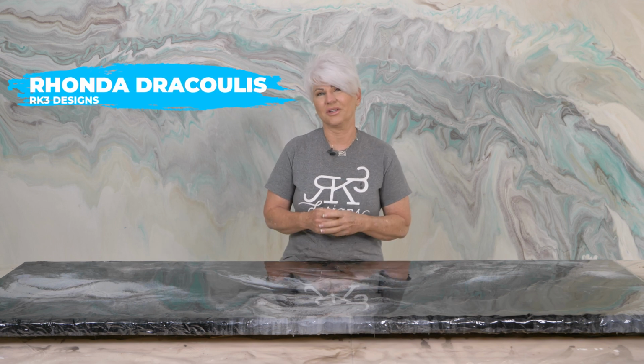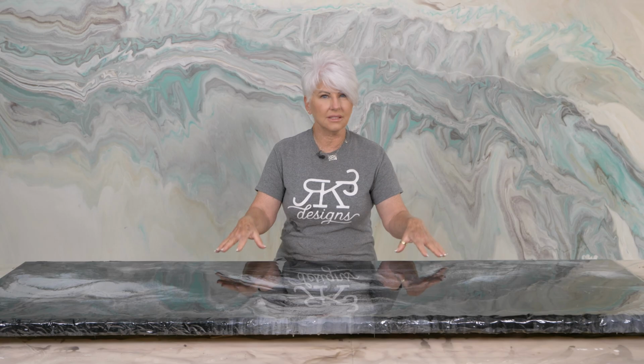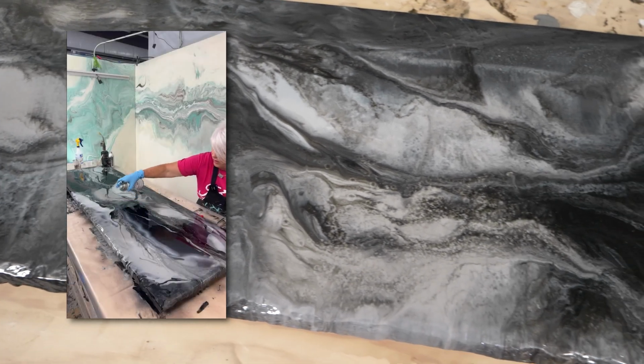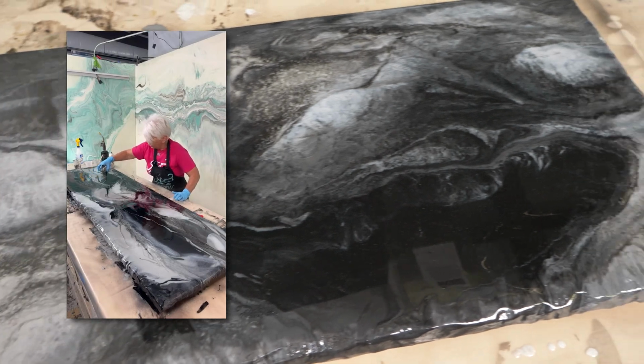So I get asked this question often: can I pour over countertops that already have epoxy? The answer is absolutely you can, with a few simple steps. This actual countertop we poured in our last live. If you want to check that out, the link will be in the description of this video. All I'm going to have to do to be able to re-pour is sand with 220, clean, and re-pour.